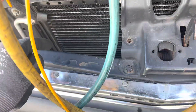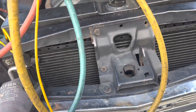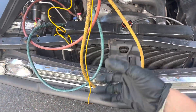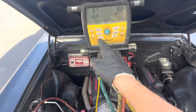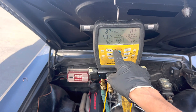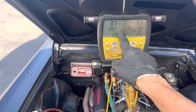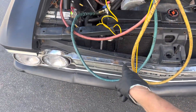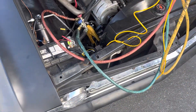The discharge temperature is 80 degrees, so there are some plugged tubes on this thing. That's probably just cheap manufacturing practices with metal debris plugging a couple of those tubes. And that will explain why I have almost a 100-degree drop in temperature across this condenser.